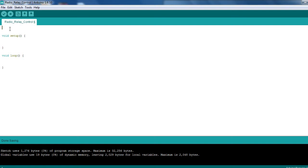Okay, so this is the code we're going to be writing. First of all, we're just going to create some integers set to 0, because obviously it's going to be a value that's going to be changing. As we go up, we're also going to be using the serial monitor just to make sure that everything we're setting up is actually working. So we'll create the first one, which is the VT pin, which is on analog 1 on the actual board itself.